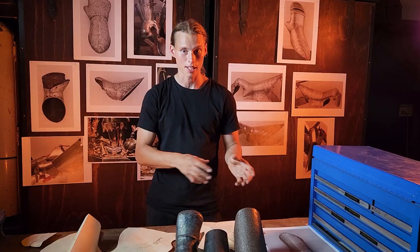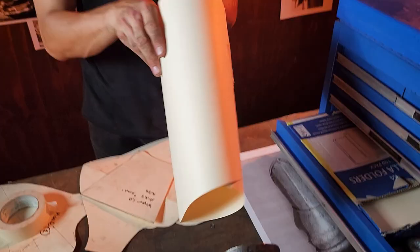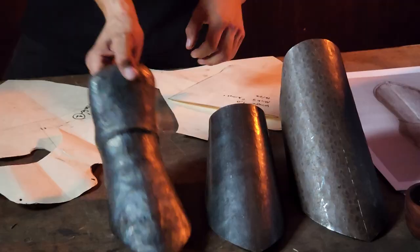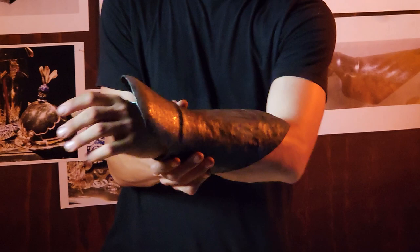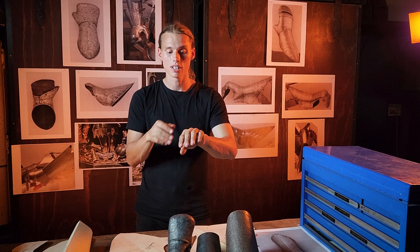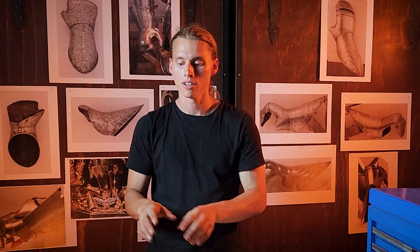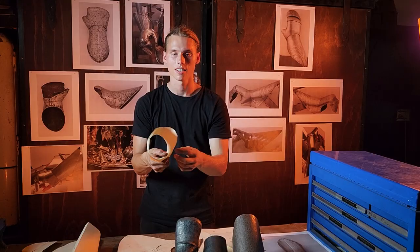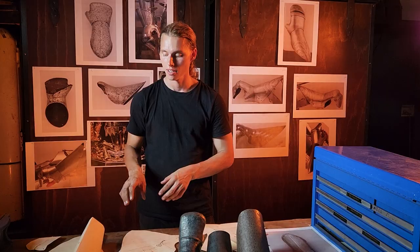What does that even mean? These patterns I developed from the gauntlets we're using in our gauntlet-making series — I started with a piece of paper, wrapped it around my hand as a cone, and started drawing onto that paper what I saw in the original. A really important thing that guides your mind when interpreting original sources: measurements. Armor is made to sculpt the human body, so your anatomy is a guide to what shape and distances need to go into the armor. Using anatomy and measurements alongside original sources, you can by trial and error work a pattern until you find something that fits the human body and functions correctly. It can be a long and technical process, but it's certainly one approach.